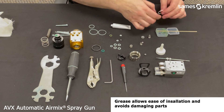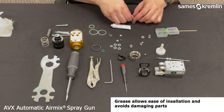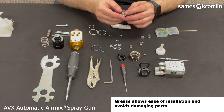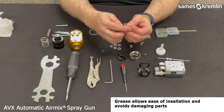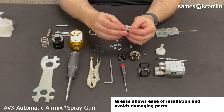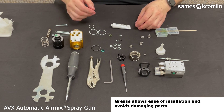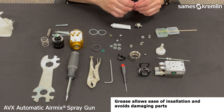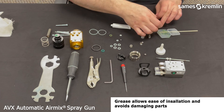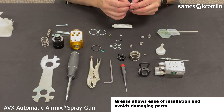Next is the seat holder. There are two rings, a top and a bottom — these are Teflon O-rings. You will also want to use a little grease to help seat the O-ring into the land, using your fingers to bring it over and seat it on both the top and the bottom.